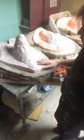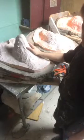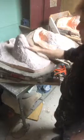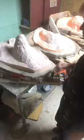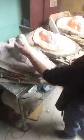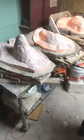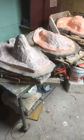Most of the time, you'll do a Bondo coat today and a fiberglass coat tomorrow. I let it cure a little longer because I kicked it a little hotter. It's a little thinner. I might chip a few spots, but nothing dramatic, so I can work with it. I've got a couple of chunks I don't like. So I'm going to, where are those good scissors? Big red ones.